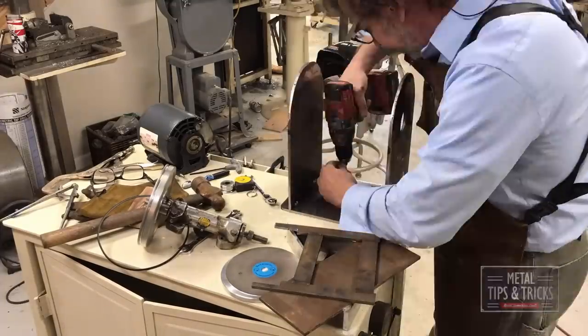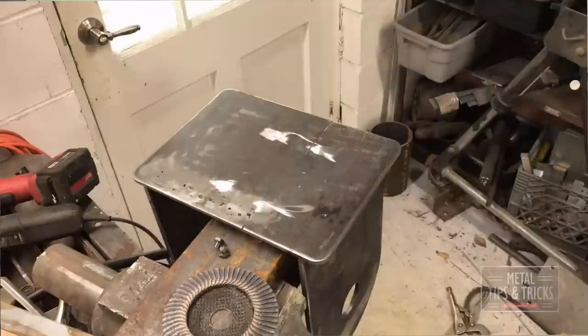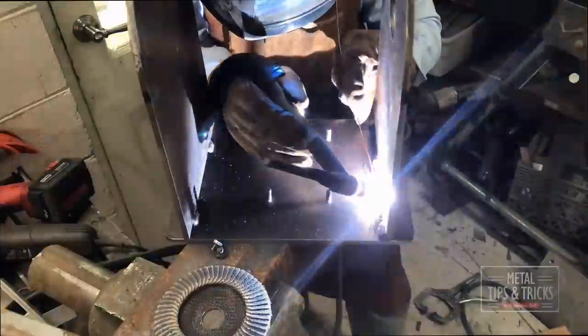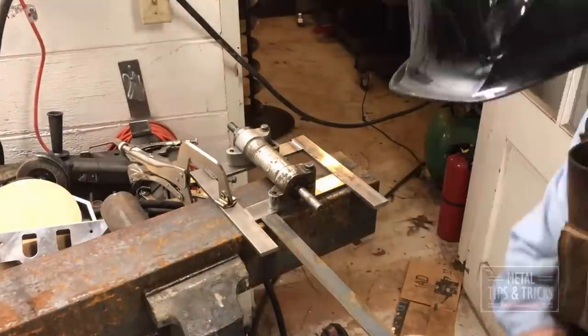Right now we want to mount the motor. I want to put four bolts in there to mount the motor to it. The best way to do that is just put the bolts in, cut them off, weld them in place, and they're never going to move. This frame is being set up just for the bearings and you'll see in a moment how it all comes together.